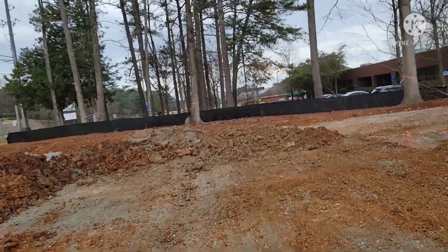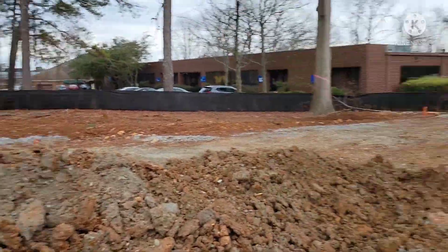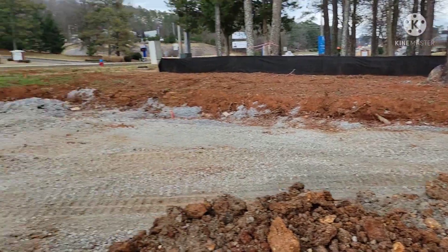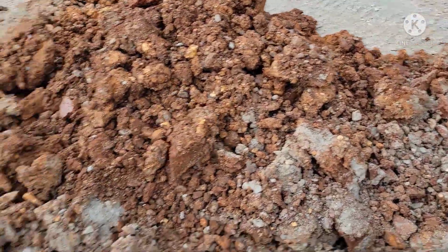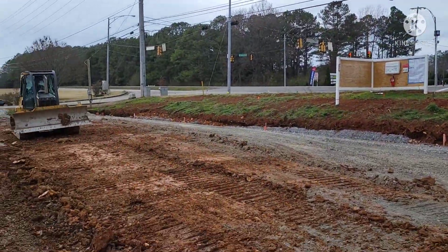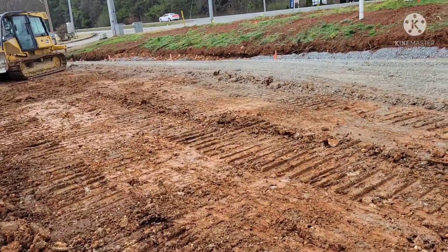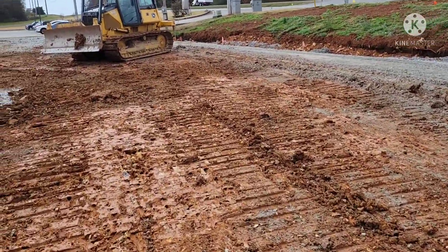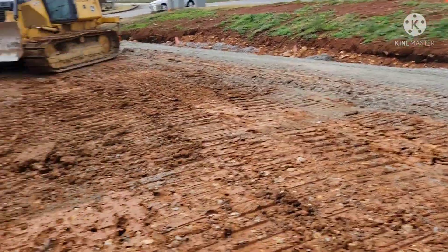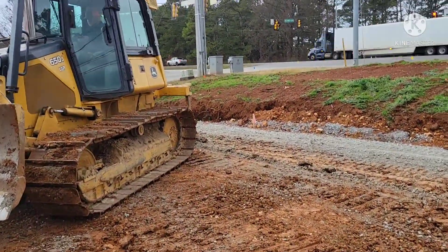Jordan's swale should stop somewhere around the corner or the middle of this parking lot extension. He's got to go down a good bit — his dirt pile is sitting right in the way, so we'll have him push all that dirt over there or move it with the skid steer. All this has to come down just a little bit. It just slopes up to the parking lot; everything drains into this box from right here at the entrance, and there's another box down there.